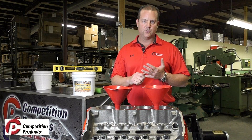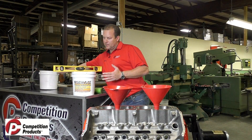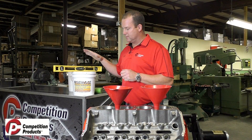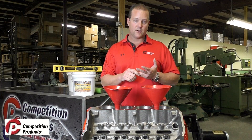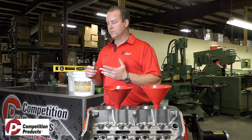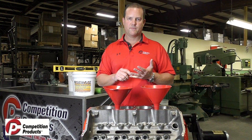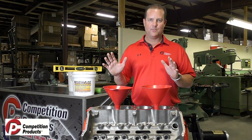The pail comes in a 25-pound package, so you're going to need to divide it in half. Get another pail, divide out half into it, then start the mixing procedure in your original pail. Follow the instructions to a tee. Another tip: use cold water — do not use hot water. If you use hot water, it will set up in the pail. Once you get cold water in and get it all mixed up, start the installation procedure. Once you start mixing, turn your phones off, don't get distracted, don't take texts, don't do any of that. You've got 15 minutes to get this stuff in.